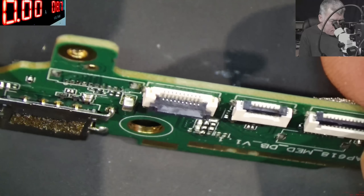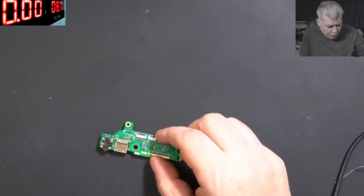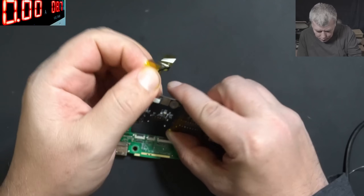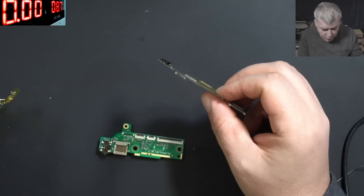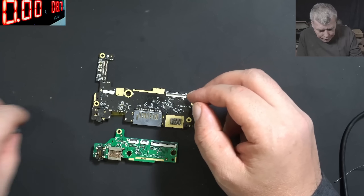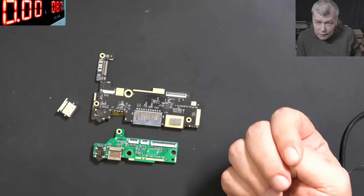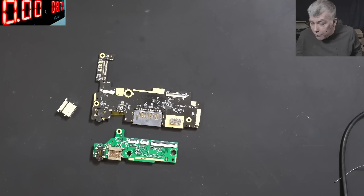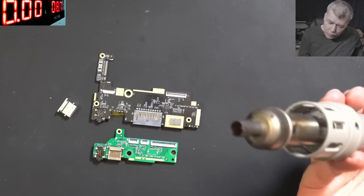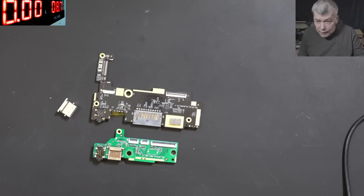Inside is clean — all good, a perfect job. Just a short video about how to do it: Kapton tape, not too much temperature because you'll melt the plastic. If you have a bigger board, spend more time heating it up but don't raise the temperature. I use 350 degrees, 45 percent air, with a medium nozzle — probably around 6mm. Thank you for watching, see you on the next one, bye.